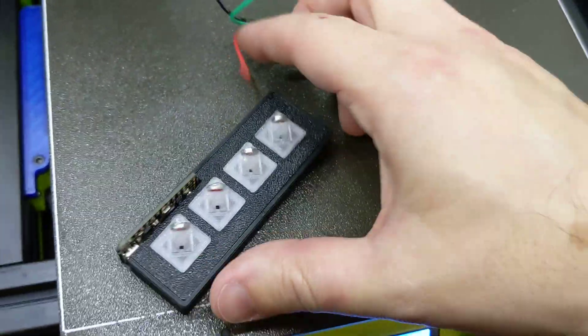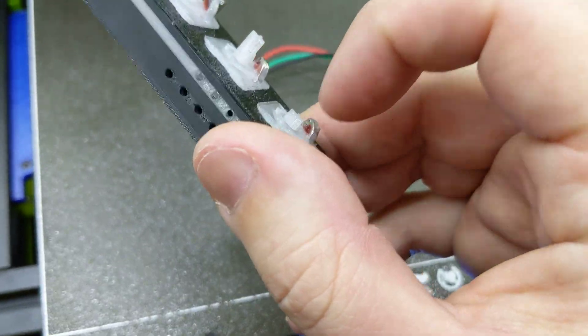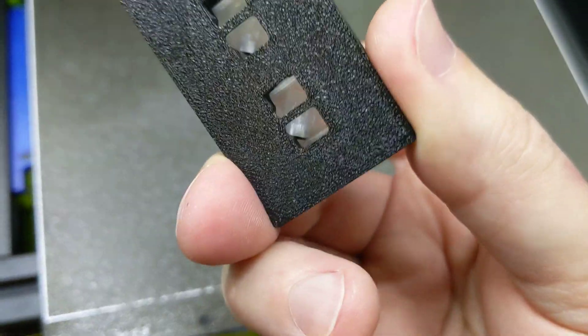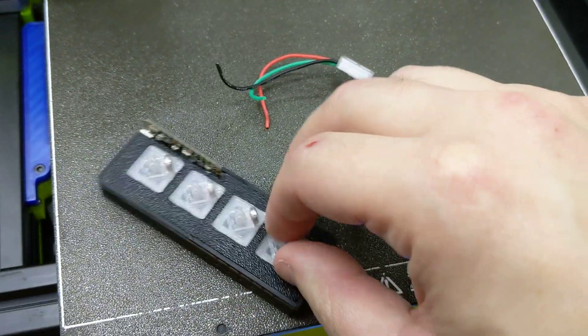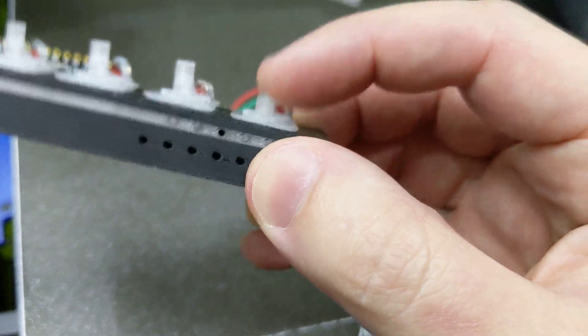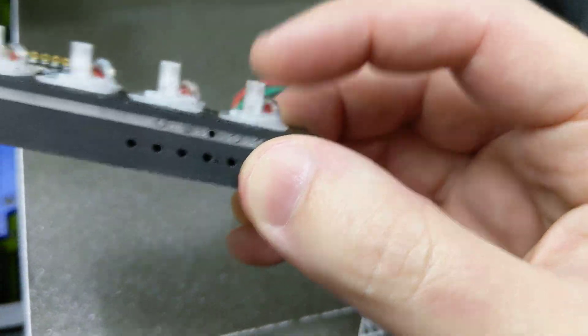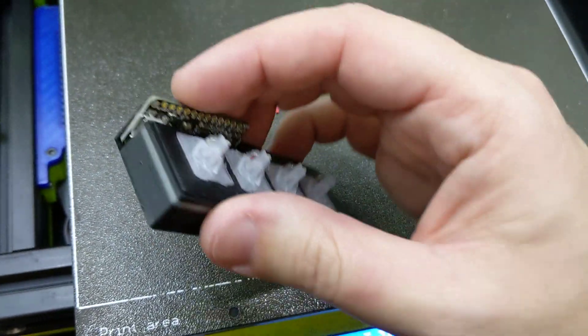Isn't that cool? Just snaps right on there. See how it went through all the way? That's the point of the stopper — because it went too far, it didn't have anything to press against, so the stem basically went beyond the point of no return. But as long as I press it the normal distance, it'll come back, and that TPU layer should help. That's the plan anyway.